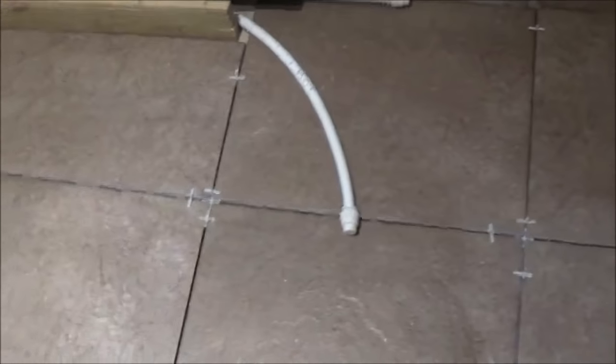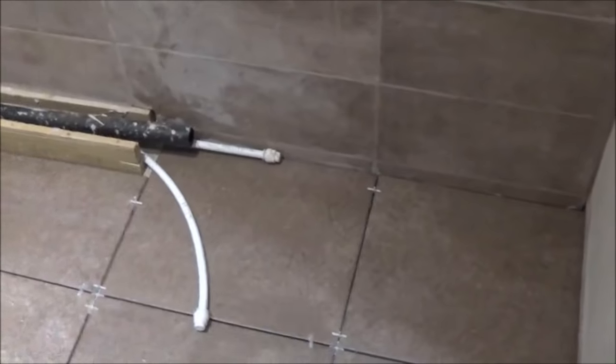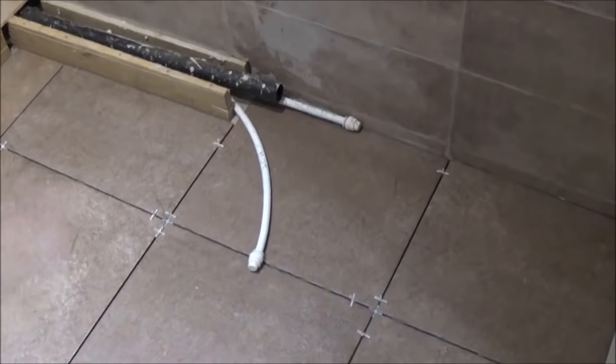If it was a big room and I didn't have anything on the floor covering the tiles, I probably would have shifted this tile along and made one a bit thinner and that one a bit wider to match up. It's entirely up to you — just plan these things beforehand so you get the feel and look of the floor or wall, whatever you're tiling, that you want. Also in this room the walls aren't square. What I've done is got the shower tray square with these two walls. I've basically worked these tiles off that wall where my sink is going, because it's going to look parallel with the sink unit — and that's probably going to be the focal point that catches the eye when you walk in.